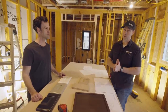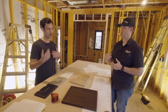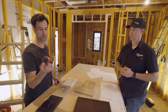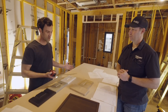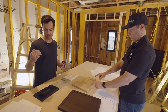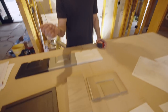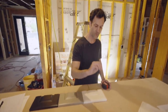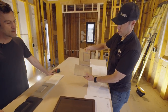On this tip, I lean heavily towards factory finished. Crystal makes an incredible product, but there are lots of factory finished cabinet makers out there. The final point is color matching and seeing your door sample come in. If we want a specific color, we pull from a Sherwin-Williams fan deck or any of these colors can be custom made. We can option and alter the sheen. For example, the designer wanted my master bath to tie into the Delta Millworks white oak flooring. We told Crystal to give us a white oak sample door and match the Delta color — and they did a great wash. It's a beautiful match.